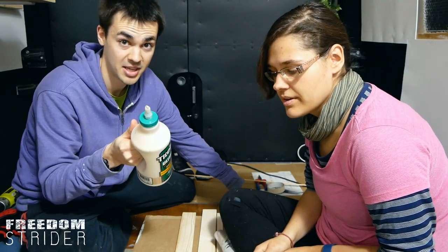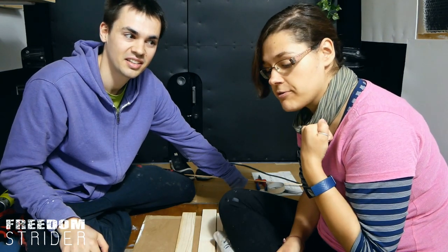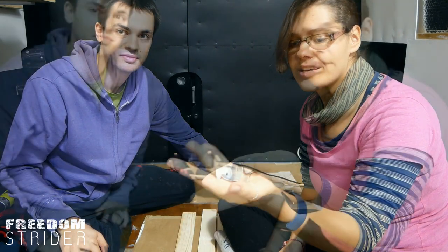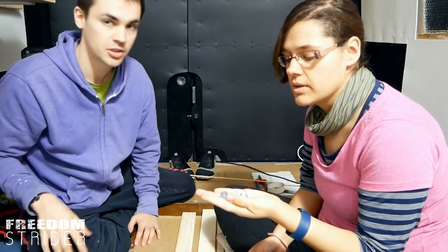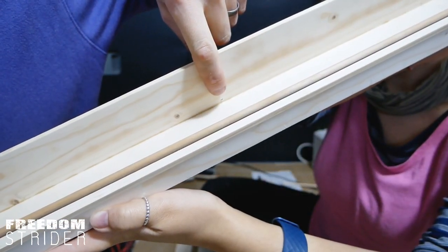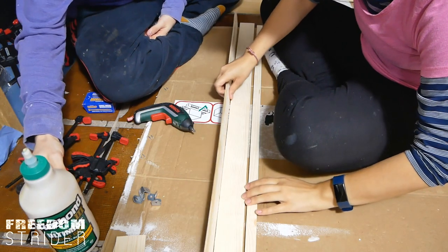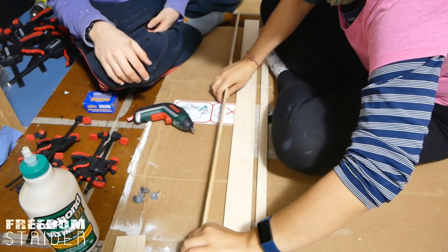We knew wood glue was the way to go — we just needed to figure out a way to clamp it. The method we came up with was to sacrifice a few holes into the wood and basically screw L-brackets in to clamp it while it's drying, then once the wood glue has dried we take those off. The holes left are really not intrusive at all. If it does bother you eventually, you can use sawdust and glue to fill the hole. So this is the base and that's the back — now we need to first screw these L-brackets on the back.